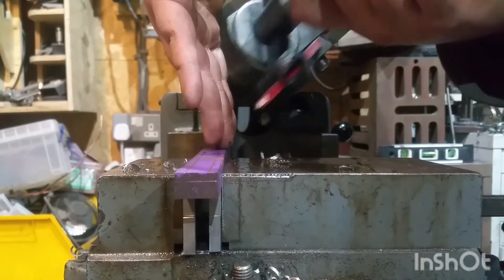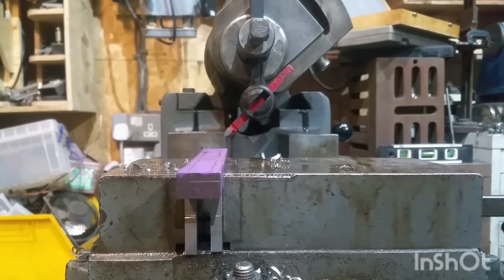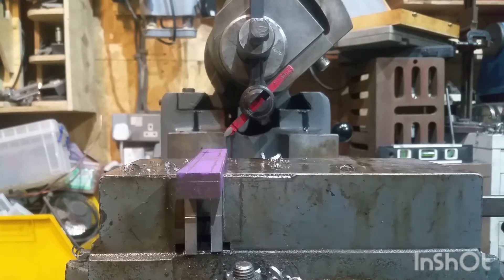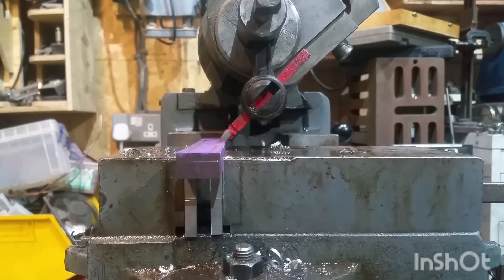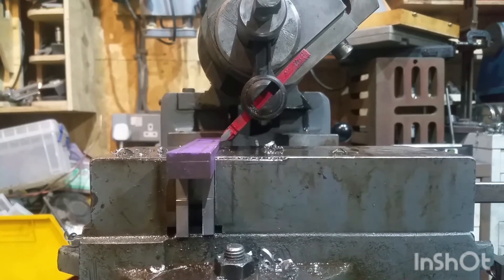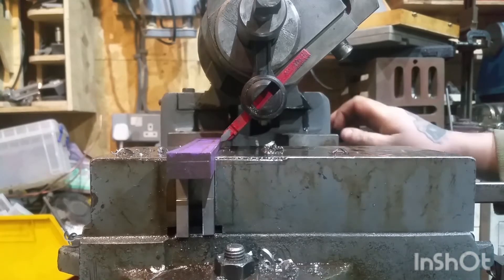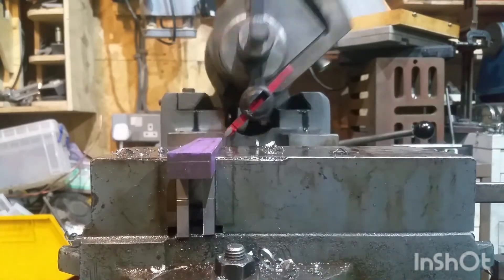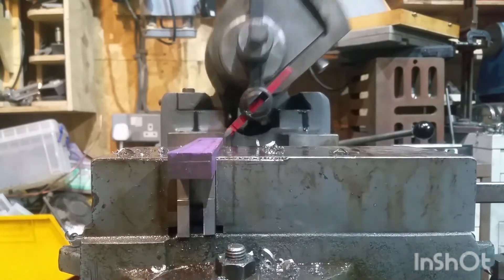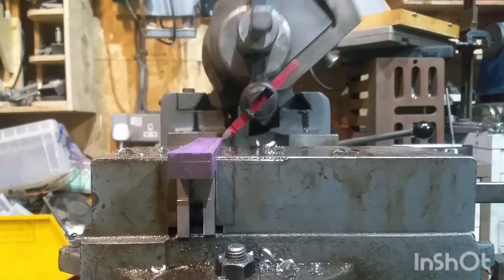This is me working out which way the clapper box needs to swing to make sure that the tool comes away from the metal on the retreating stroke. I guess much like when I started using the mill — I always touch off whilst setting up the next cut. I don't have a DRO on the mill; I definitely don't have a DRO on the shaper. It's just habit for me, touching off before cuts.